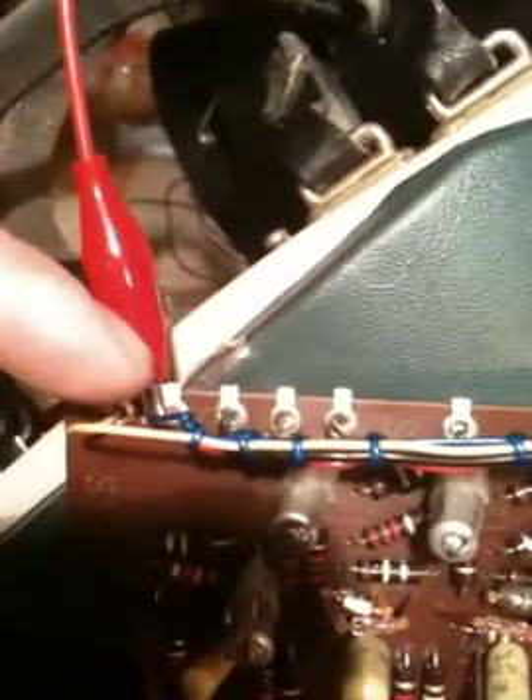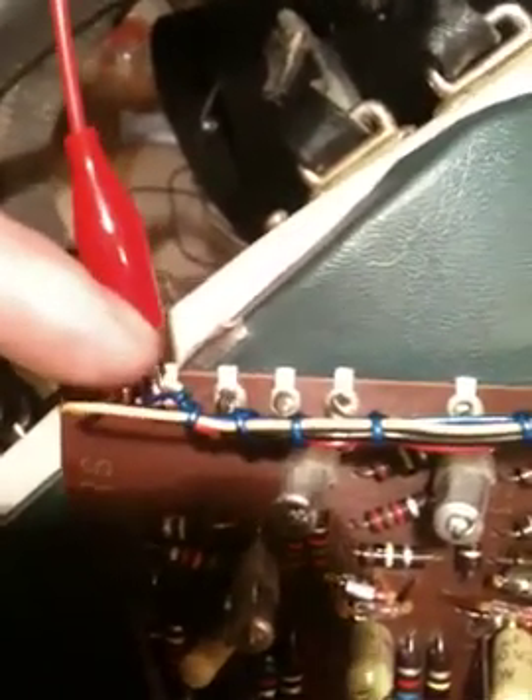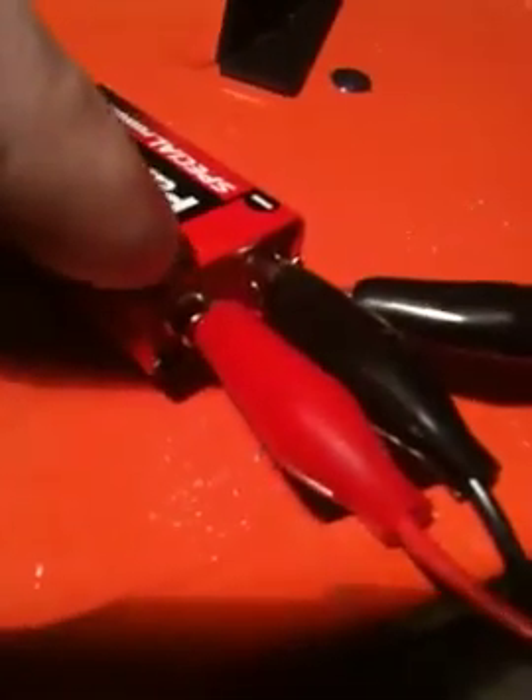Here's my dodgy generator board. On the back of it — I can't really move this around a great deal — it's marked where the positive and negative for each of the frequency tags are. I've already wired up a crocodile clip onto the positive, which is a power supply, and I've tied that to the positive on a normal guitar stompbox battery.